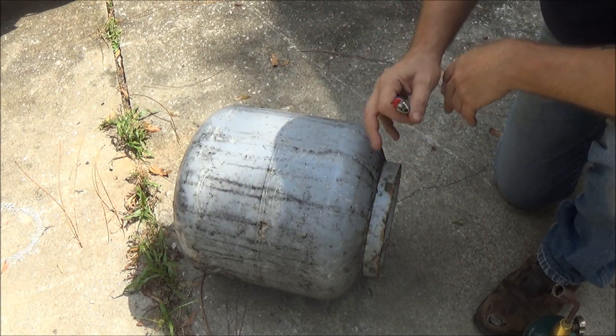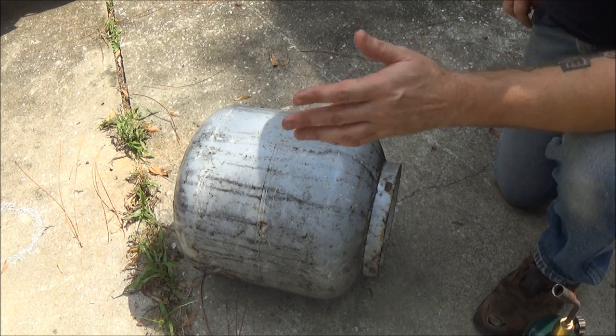So that's how you clean your propane tank if you want to cut one in half. You won't have any problems. Then you can cut on it all day long — you can cut it with a torch, you can cut it with a plasma cutter, it's not going to blow up on you. But if you want a good straight cut, I would use a cutoff wheel — either pneumatic. If you're going to fill it up with water, you want to use air, something that's not electric. All I've got is my four-inch grinder, so I'm not going to fill it up with water. But if you feel comfortable doing that, by all means do it.